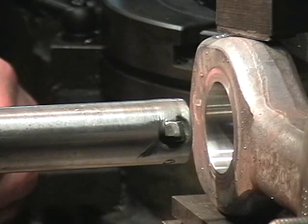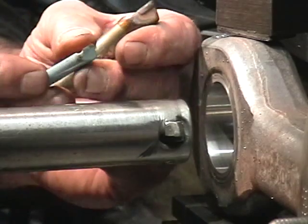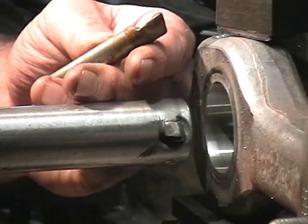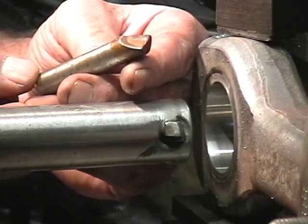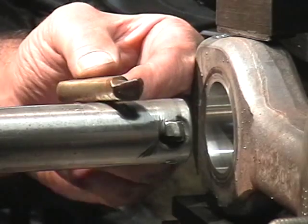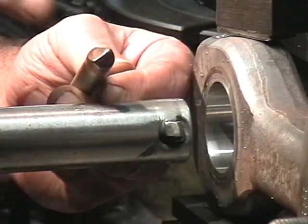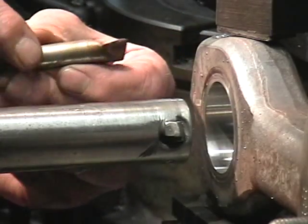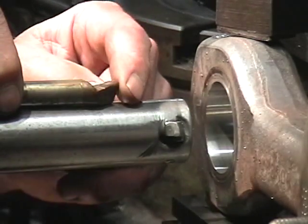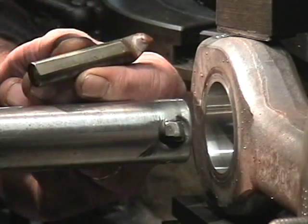You can get round tools. This would be a TRC-5, 5/16th round. This would be a TRC-8 — half inch round. The difference between these and the square ones is the carbide: if this is in the middle of the bar, the carbide is a little bit closer to the center of the bore. It's still a bit above center.